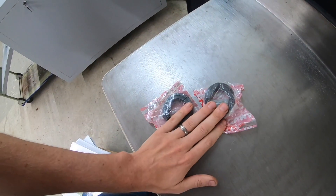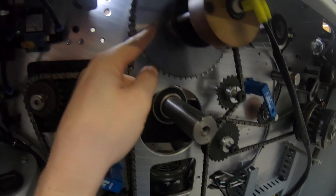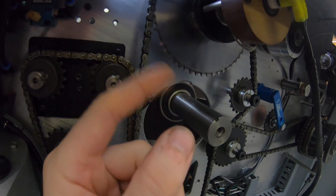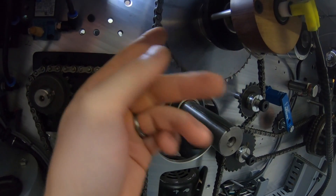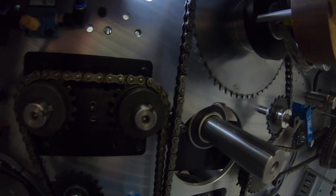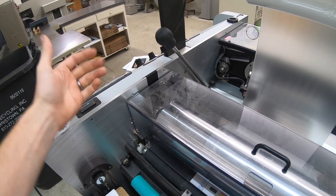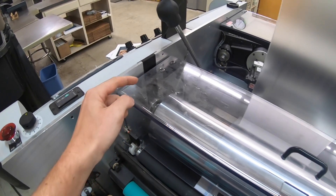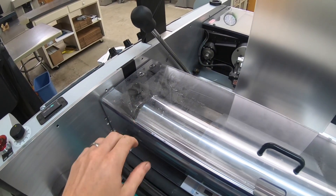Collars are here — let's throw them in. That spacer was tricky to get in there, but you can see that collar right there. That's going to keep this gear from moving in — that's where it travels, it travels in. So it acts as two things: it's a spacer to physically stop it from moving, and it's also squeezing that shaft and holding its place. I think that'll be the last time I have to mess with this. Since I have two collars, putting one on the outside isn't really going to do anything because the shaft is moving to the side, so I'm going to put the second one on this side of the metal plate here to keep it from moving that way.